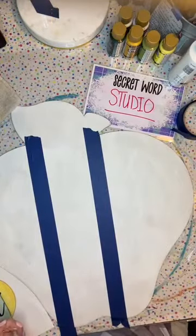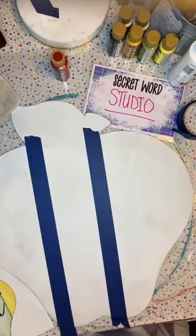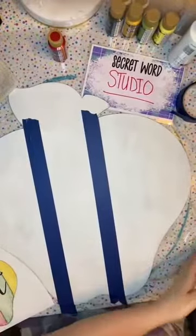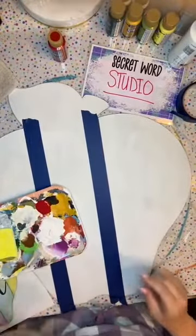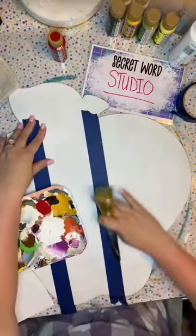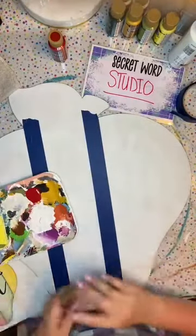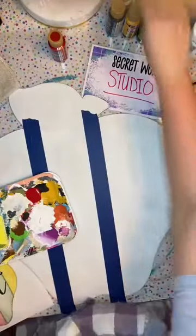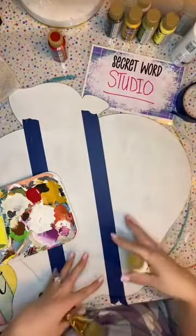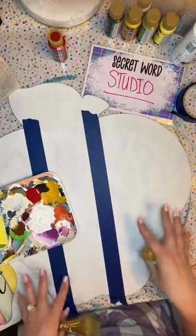Yeah, outside. Okay, so I've got Santa Red right here. I'm gonna take my 2-inch base coat brush, and we are going to add just a little bit of light buttermilk, okay? I told you that we're base coating in white. The white makes all our bright colors pop. We've got yellow, light buttermilk, the green, all those colors on the natural wood color itself kind of dulls down because it's soaking into the wood. But if you put a white barrier between the wood and bright colors, it makes everything nice, bright, and poppy.